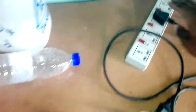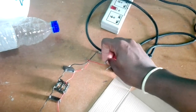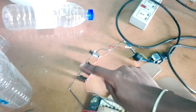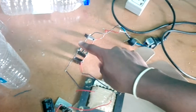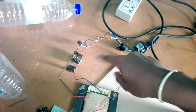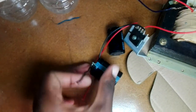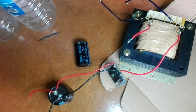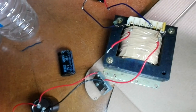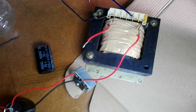In this circuitry we have our AC input, then some filtering: a choke to filter interference, another capacitor, another choke, and another capacitor. Then we have the transformer, followed by a bridge rectifier, and a capacitor to smooth the output. The two chokes handle differential noise and common mode noise. This transformer gives an output of 17 volts when input is around 240 volts, and after rectification the output voltage can reach up to 23 volts.